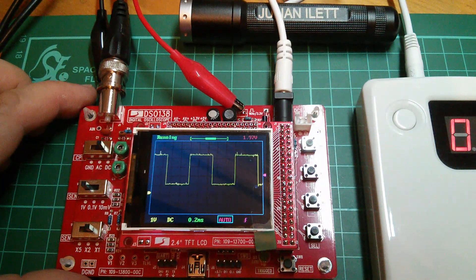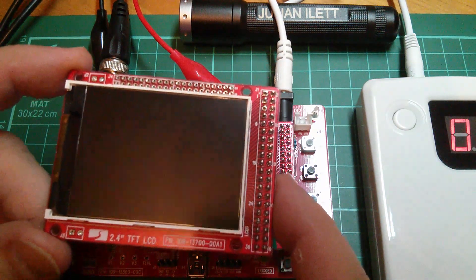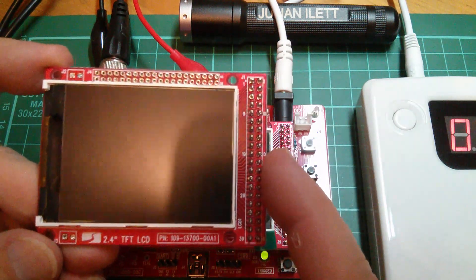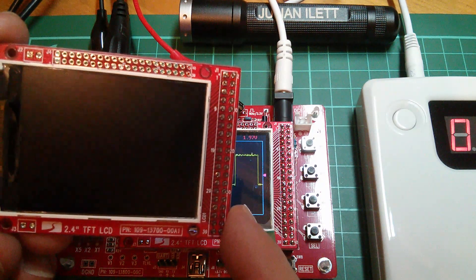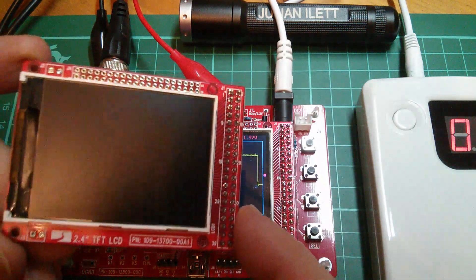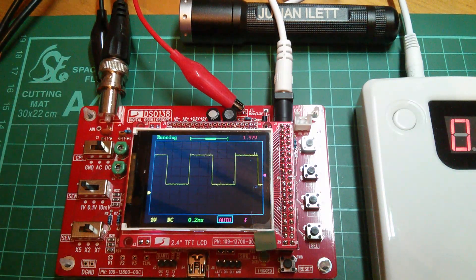Anyway it works — that's it, it's finished. It's very stable in time base and the analog seems quite accurate, but the noise is just really excessive. As for the LCD, I don't really know what caused the first one to fail — maybe it was static. The best thing they could do when shipping this kit, if it's static sensitive, is to put it in an anti-static bag with suitable labels and warnings. But anyway, with the new LCD it's now working, so my kit build is finished. Cheerio.